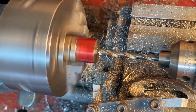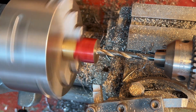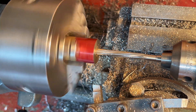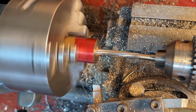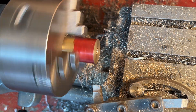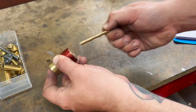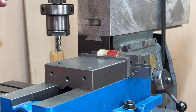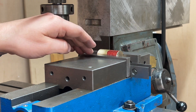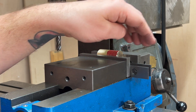This is 15/64s because I want to end up with a quarter inch. I've diverged slightly from Myford Boy's order of operations — he squared his valve chest up first and then drilled the hole. Since I had that set up in the lathe anyway to get to the right length, I thought I'd drill first.